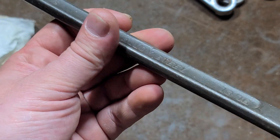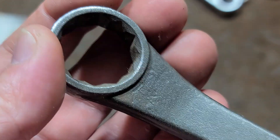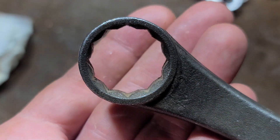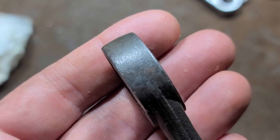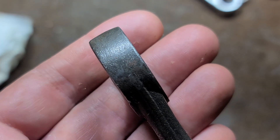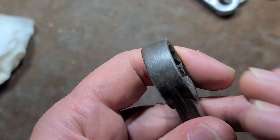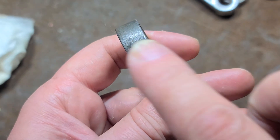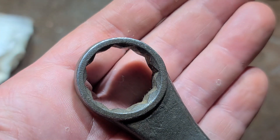But otherwise, a really nice straight wrench. Snap-ons have had flank drive for a long time, but many wrenches didn't — and this one does not. Still has a pretty tight fit. The grinding on the box ends is really pretty straight and even. You run into a lot of wrenches now where it's angled one way or another, or really lopsided. But this is just really squared off.